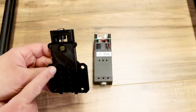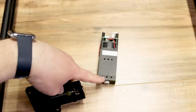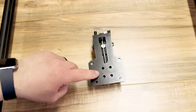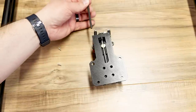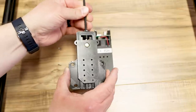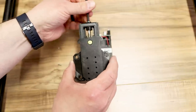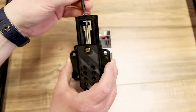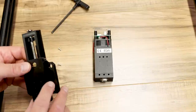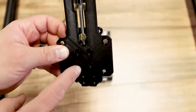I want to set this up as high as I can so I can raise it all the way up and lower it if needed. I want the top screws to go into the bottom of the diode. Since this is pre-assembled I need to lower the plate so the top holes are where I want them. Grab the allen wrench, flip the assembly over, and turn it so the plate slides down. In my case I'm actually using the second holes down because I have a G8 lens which needs a slightly longer focal point. Once I can see the holes align, I can screw through them.